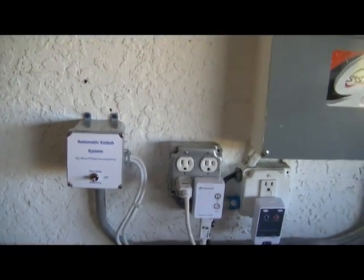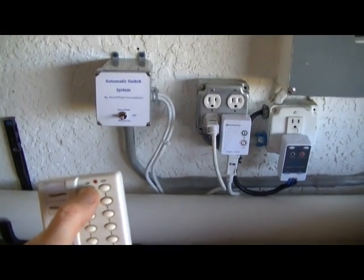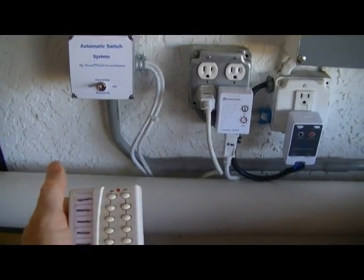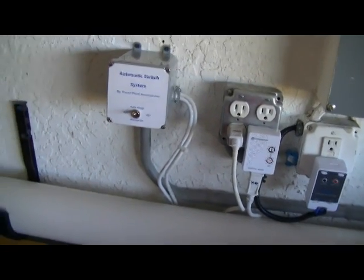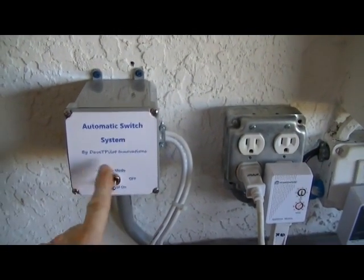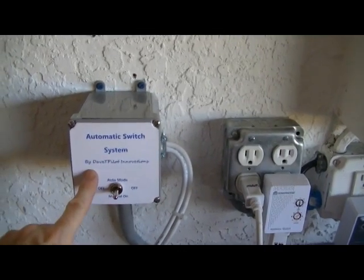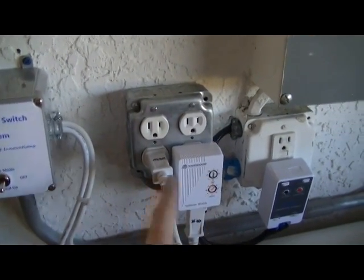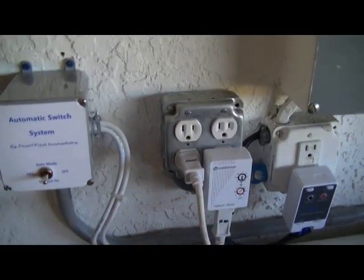It's a really sleek system, it works really well. I can show you all the different modes — auto mode or remote mode. I have to put the switch in auto, and with it in auto I can use my remote. The reason I have a three position switch is it's important to completely disconnect the X10 module power before adding straight power out of the wall. Because if this feeds back to the X10 module, it causes the X10 module to chatter on and off, which is not good.